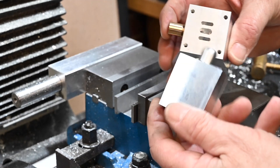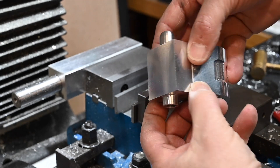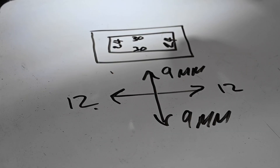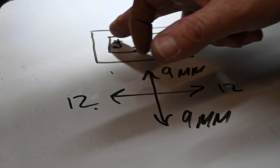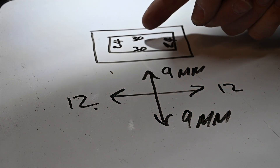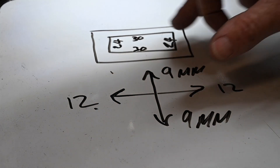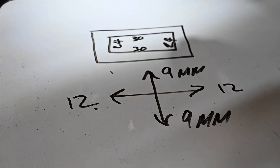That's the steam chest, which will fit on the side of the cylinder. I've just got to cut the pocket out now and drill the four holes. I've centered the work up and I'm using a 6mm bit. I've got to go 30mm out that way and 24mm that way to take the pocket out. Starting from the center I've got to go 9mm each way and 12mm each way to get the position for the pocket, but I'm only going to go 11 each way and 8 each way initially and then do the final pass to clean it up.